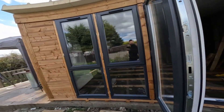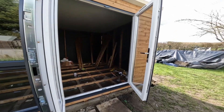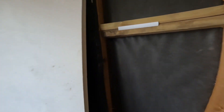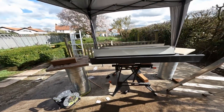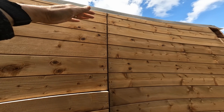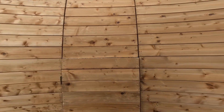I've got loads of trim to put on - it's going to be really neat and tidy when it's finished. This is all the trim to finish the outside and around the doors. I've also got the insulated wall panels here - cladding on the outside. And I wanted to show you the door that me and my father-in-law made yesterday. This is going to be the entrance into what will be the observatory with the roll-off roof. I had to work out a rough idea of height because the roll-off roof is going to be lower than the main roof, and there's going to be another roof joining the two buildings together, so I need an overlap of those two roofs. This had to be below both.